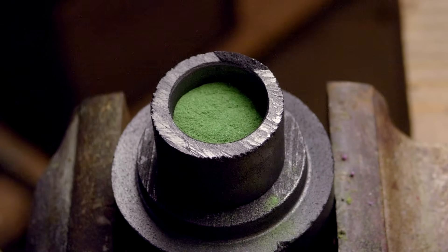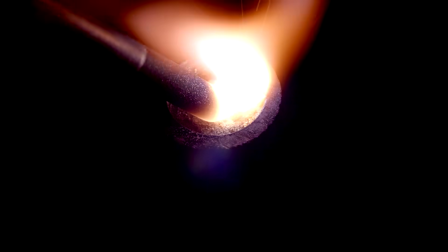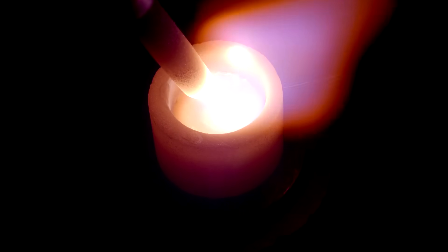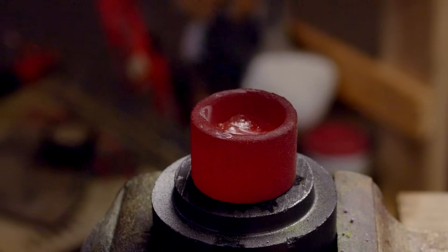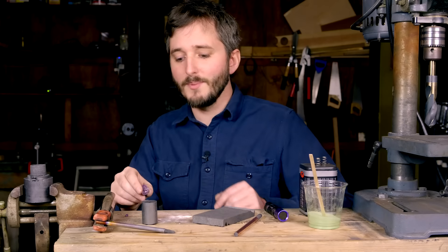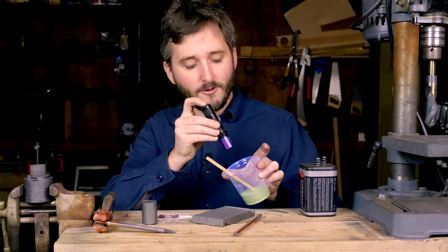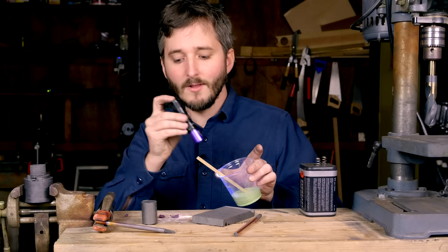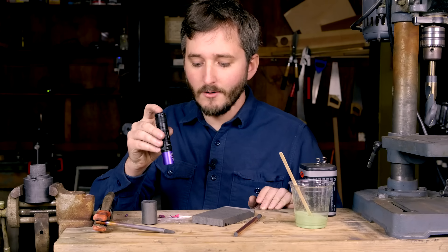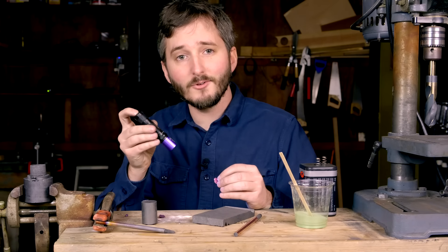The first time using the crucible, I think I got the carbon arc a little too close to the ruby material and transferred quite a lot of carbon — slowly eroding away off my electrode — into the ruby. But once I had this ruby finished and put it under fluorescent light, it does glow brilliantly, which is a sure sign that I've created ruby. The base material is green; ruby is pink. The base material also has no fluorescence at all, so you can tell something has inherently changed with the properties of this material. That's a sure sign we have indeed created ruby.